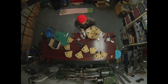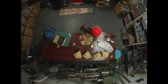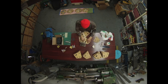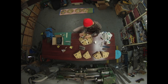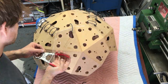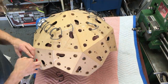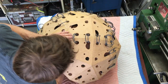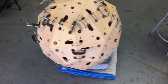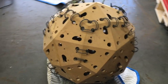My assembly strategy for this jig was to prefab these pentagonal shapes out of the pieces, make all these shapes, and then assemble the pentagonal shapes together. This is just normal wood glue - I like to use Titebond 3. It has a little bit more working time than the other Titebond glues and I've had good luck with it. The reason I'm using C clamps there is that with the last piece I had a little bit of trouble and needed a little bit more pressure.